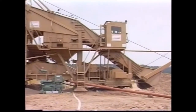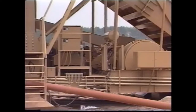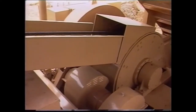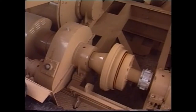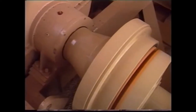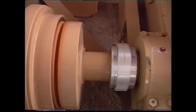Now we'll take a look at the core of the plant at bottom right. This is where the two-drum scraper winch is accommodated. Left, the drum for the in-haul rope, in the middle, the clutch, and right, the drum for the out-haul rope. Both drums are connected to the main drive unit via the clutch. For a better view of the mechanism, the cover has been removed.